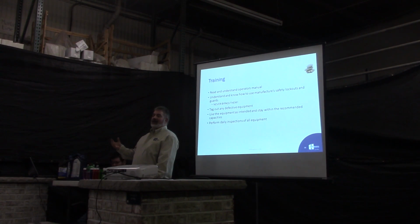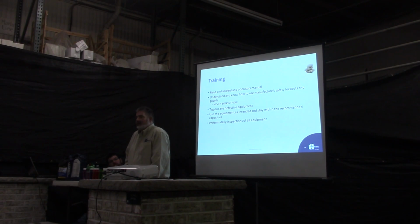Where you can get problems with the ethanol gasoline is the alcohol will evaporate off and it changes some characteristics. I found that if you're going to store your fuel long term, they make the stabilizer, the ethanol stabilizer for ethanol gas. That works pretty good. Just on a side note, that's what I use in my boat all the time. I fill up my tank with gas and I use ethanol stabilizer, and it works good. I use it once a year and I never have a problem. Knock on wood.